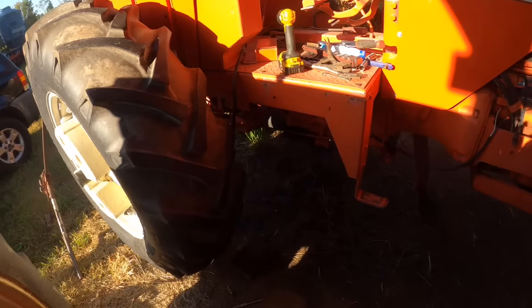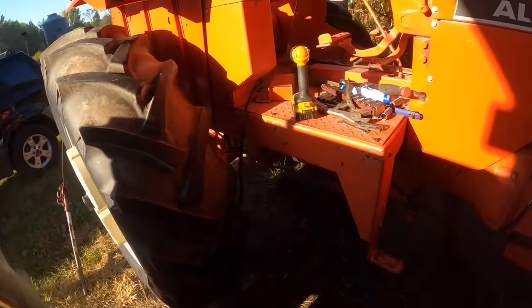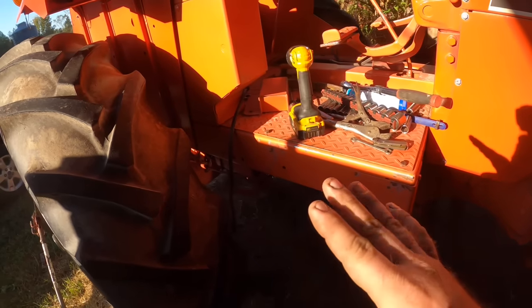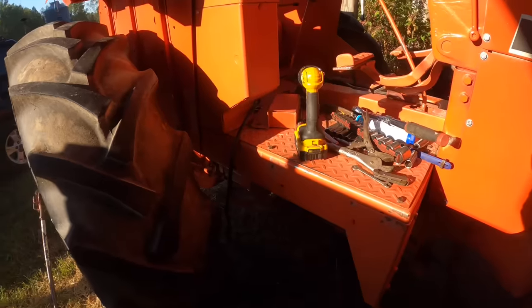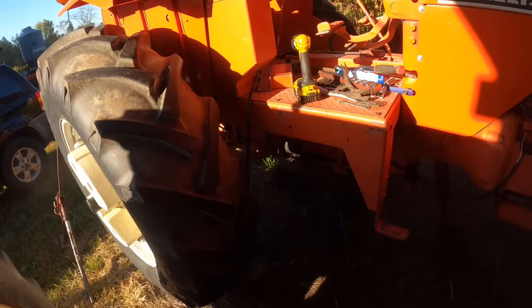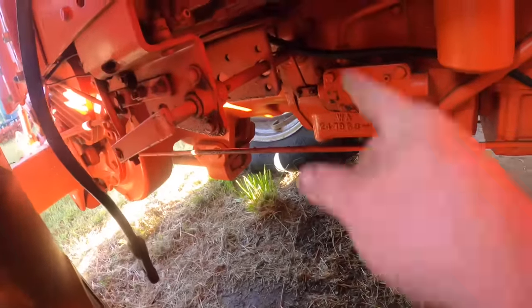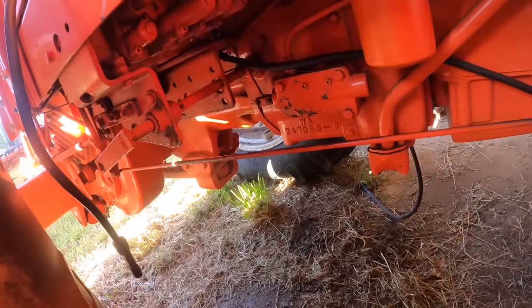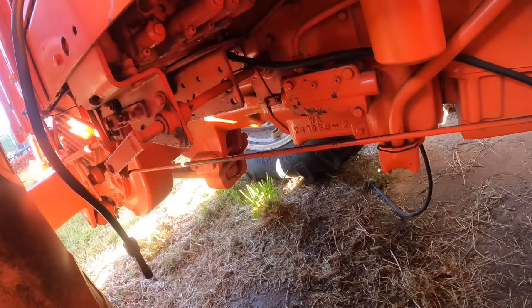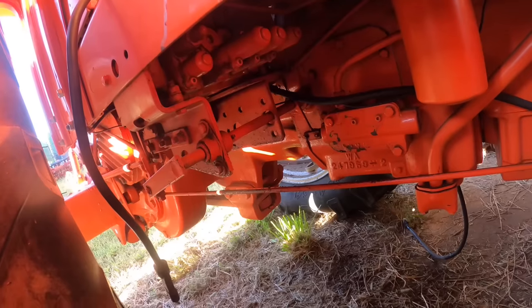Fixing that is not an easy task, as we decided last time. The route I'm going to go is the route we usually went at the shop — jack up the platform in the back; it will tilt up. I got the four bolts loose under the seat, that's what you have to do. I refreshed my memory on this by discussing it with them. We also have to take the hand clutch linkage loose out of the side of the tractor because it actually pivots in the transmission case.